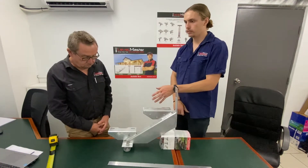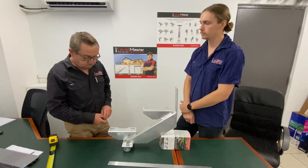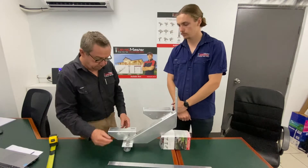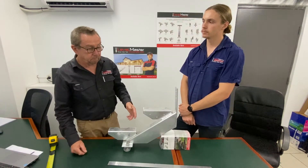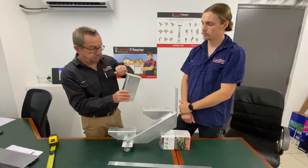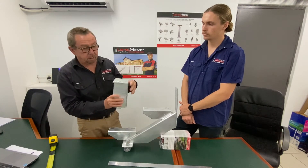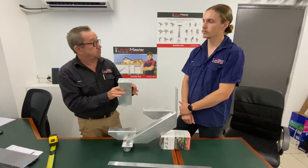In terms of different base plates and other alternatives to the bolt-down — this is the bolt-down version. The cast-in version uses a very similar adapter plate except it just has a long leg. This gets cast down into the concrete and gets bolted up the same way as the bolt-down version. So again you've got your adjustability, with the foot ending up down into the concrete pad.